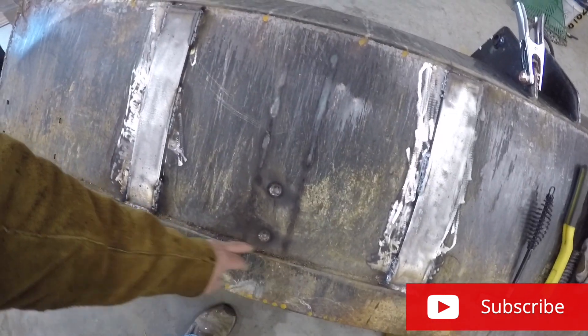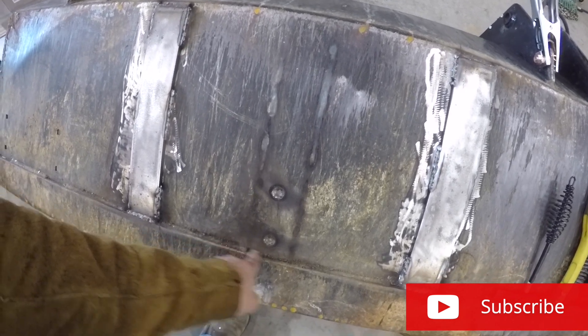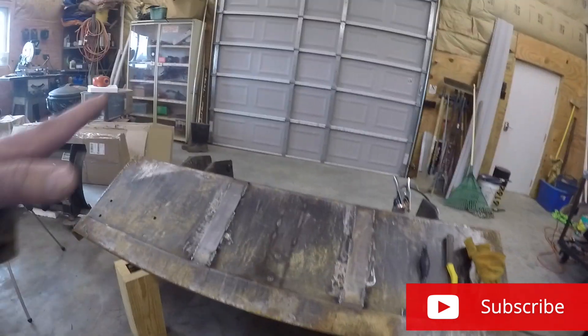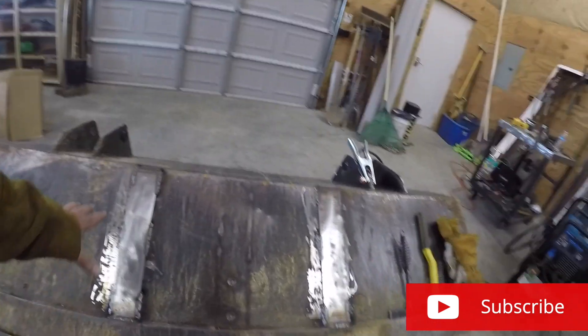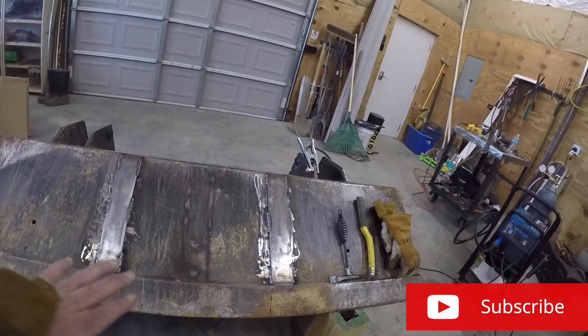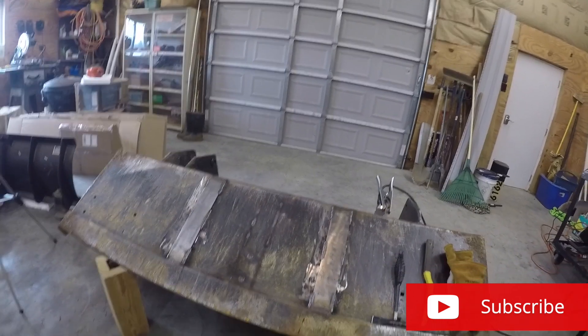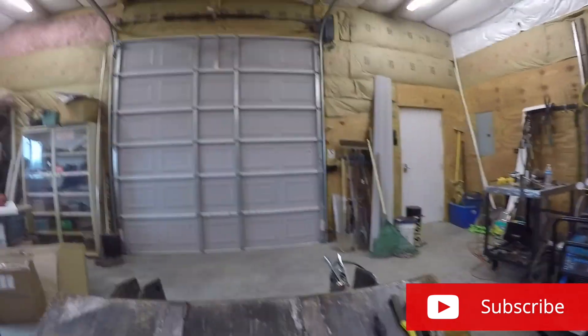As you can see, it's got a nice thick cutting edge on here — about a half-inch cutting edge. This is the back side of the bucket, so you're looking at underneath of it. By putting this underneath there, when I hit something it shouldn't buckle the bucket like it did before. Thanks everybody for watching, I appreciate all my subscribers — let's get out and do something.